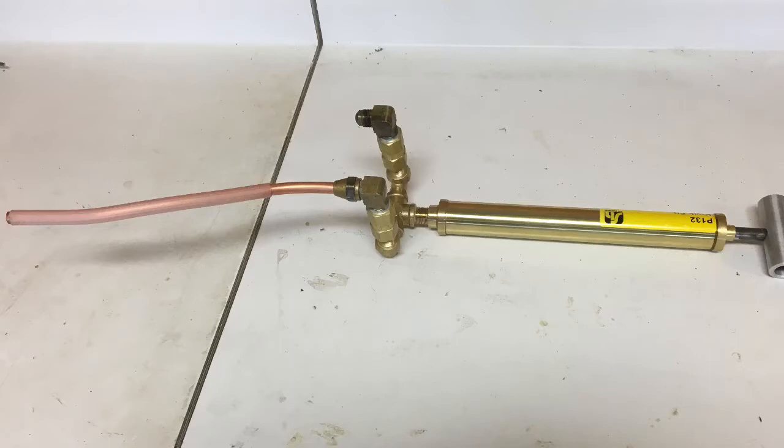There are several different methods to clearing an oil line. In this video, we will be focusing on two of the most common ones. First, pushing the oil out of the filter holder at the oil tank, and second, pulling the oil out of the oil shutoff valve, also known as the Fire-O-Matic, at the burner.